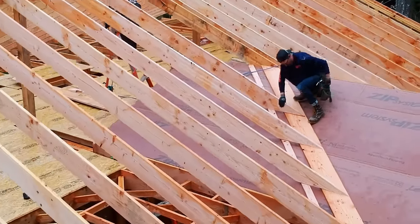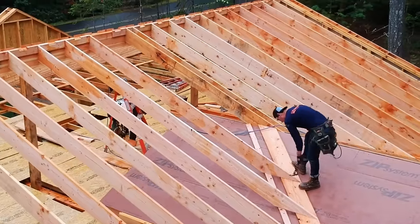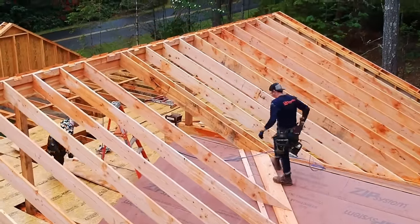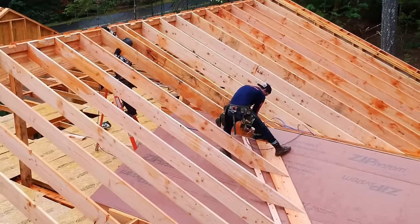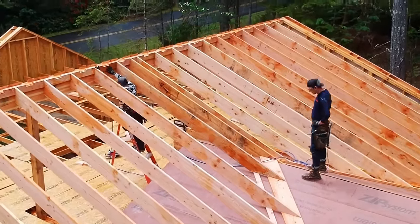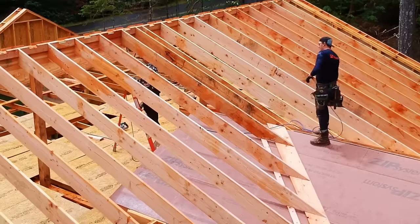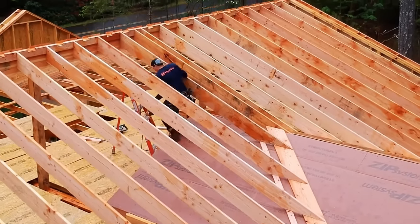So obviously, remember earlier in, I think, the last video when we pulled layout across the back plates? Now you can see why we did that. That way 2 foot on center stays all the way through. When we sheet up and around these valleys, then we're gonna still split on rafters and nothing's gonna have to get pulled off layout. No, nothing needs to get added, et cetera, et cetera.